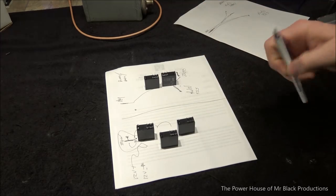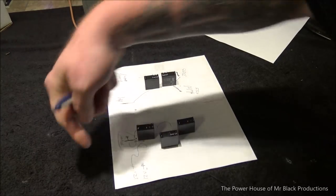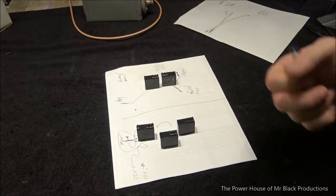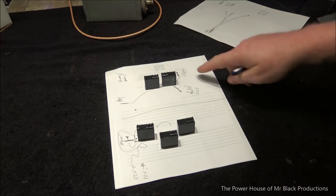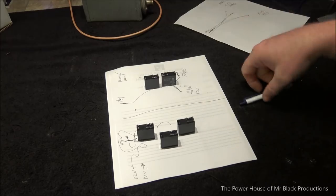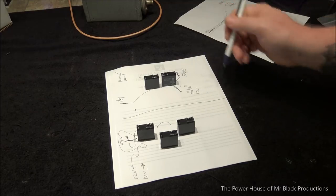So Steve's going to have two pieces of wire coming out of this side of the cabinet. He's going to have a plug going in, two pieces of wire coming out that he's got to tie into his mic plugs on the front of the radio. And what he does with his audio lines from there, that's his business, but they're both independent of each other. So the 7300 is going to have a mic jack plugged into it with two wires attached to it, where it's going to take the shield at the 7300 and it's going to kick it over to the transmit, which is switch ground, and that's going to put the 7300 into transmit.